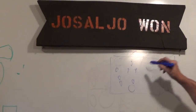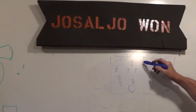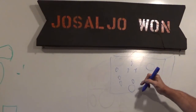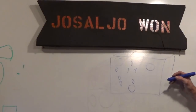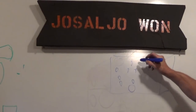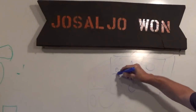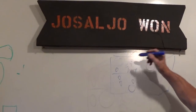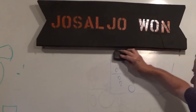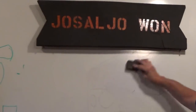So think of it this way. If this was 50% relative humidity and we heated it, let's say the temperature went from 50 to 100, okay, or from 60 to 120, then we could get twice as much water. We would cut this in half and only have 25%. Now that's not a positive, exact, accurate way of thinking about it, but it's a good way to consider it, okay? So that'll give you an idea of how you can work with your kiln.